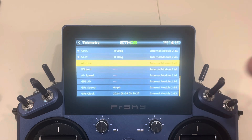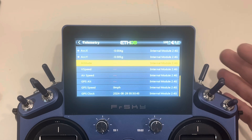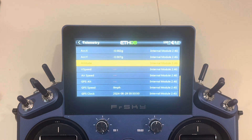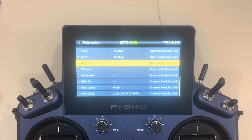It'll adjust in a second and find the right altitude now that I'm inside a building — sometimes it's a little slow to recognize, but when we go outside we'll see it recognizes very well. So if I were to change locations and I want to always zero that altitude out to be my ground level where I am now, that's why you might want the altitude on a calibration switch.